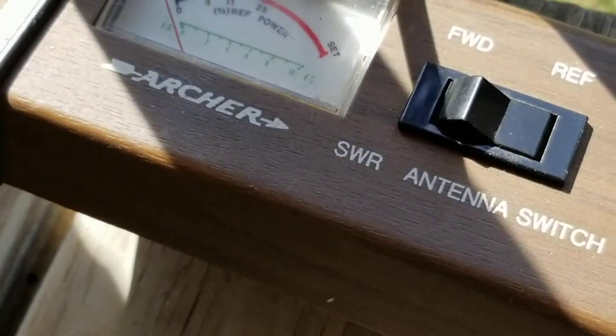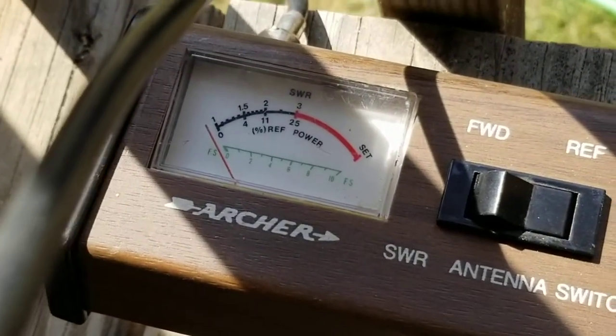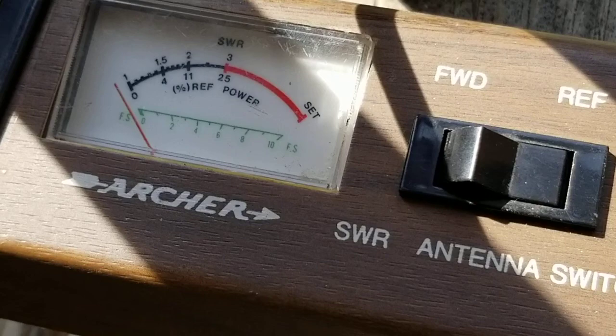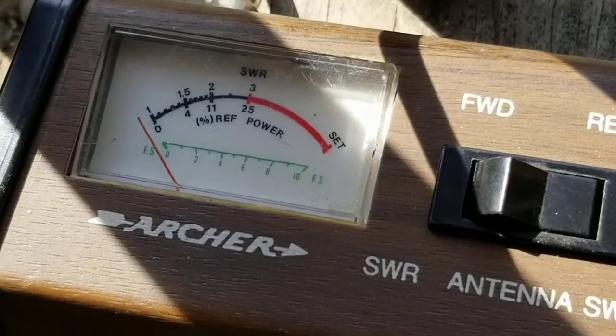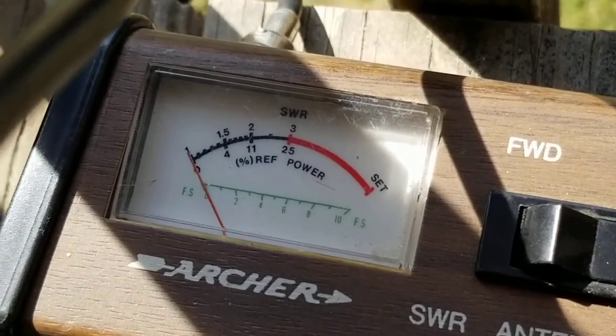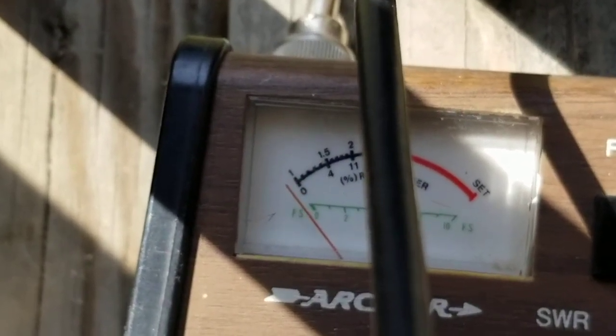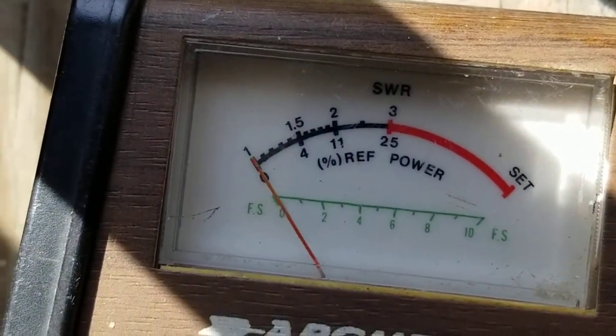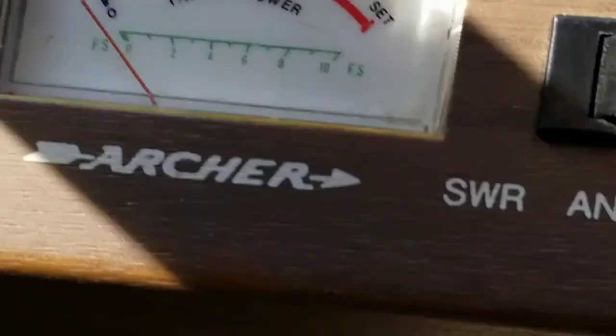1.1, 1.0 — that's amazing. Let me show it again. I had to make adjustments. This is on channel 1 right now, running 102-inch whips on both sides of the speaker wire. I'll show you guys in a minute. There we go — 1.0 on channel 1. And I'll do channel 40 in a second.